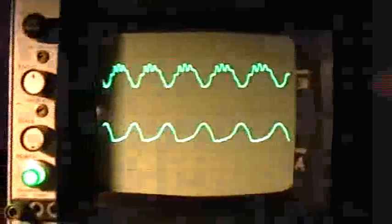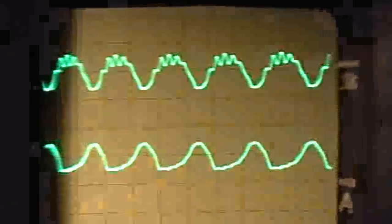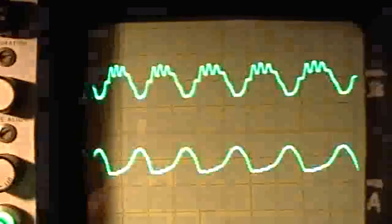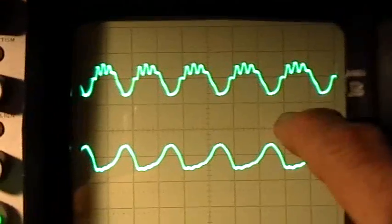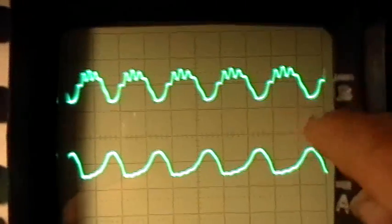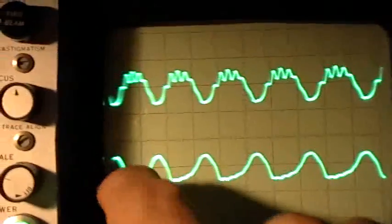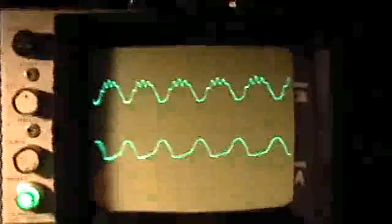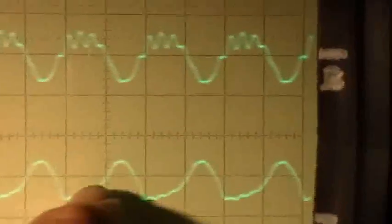Now remember where that negative line is. Right, it's right on that graticule marker. So I can tell you from long experience doing this that this times this is going to produce a negative power product. I think it's pretty easy to see. There's a lot of area underneath the line, meaning a negative current, right? And then when that's multiplied by the battery ripple, you will get a negative power product, I promise you. And pretty strongly negative too. You can tell that just from the difference in these areas and the difference in heights and widths of these curves here.